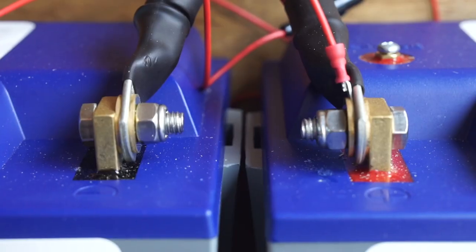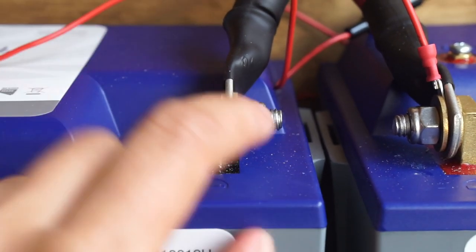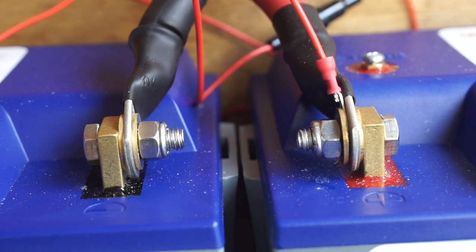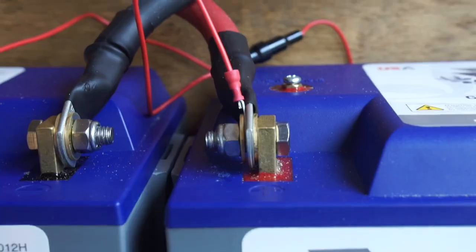Something I've deduced from connecting everything is that for every wire lug or ring terminal you want to have a washer, a locking washer, or a lock nut when connecting things securely. You want an even distribution of connection on all of your terminals. So you have your bolt, then a washer, your wire lug, another washer, and then your locking nut. The washers help sandwich the lug together so there's an even distribution on all of the exposed metal. This is especially important when you have multiple ring terminals connecting together. If you don't have washers when tightening down on the nut, it can end up crimping into the wire lug itself and wearing away that metal quicker.